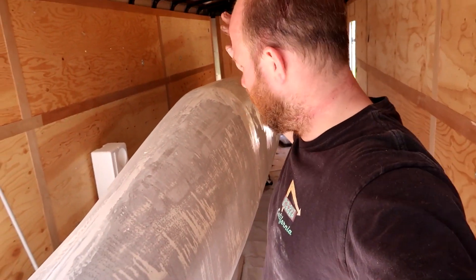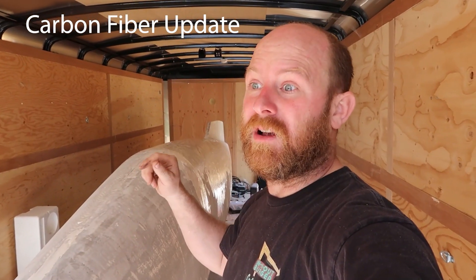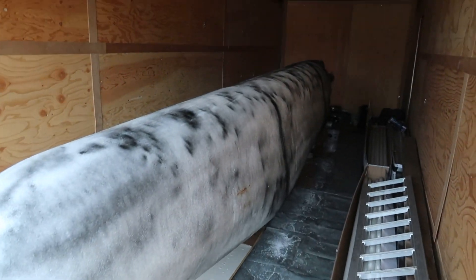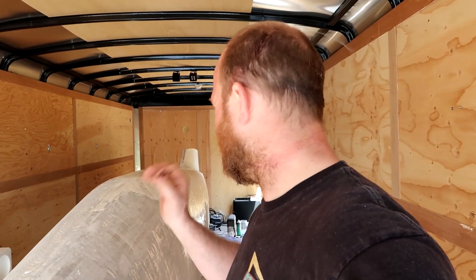I'll go over the whole thing I've done so far. I started with a coat of TotalBoat over the whole entire thing to give a nice candy shell. After that I basically block sanded down to almost spots where it was completely foam, and then I used a thinner epoxy from eBay that was relatively cheaper so I could just start slathering it on.